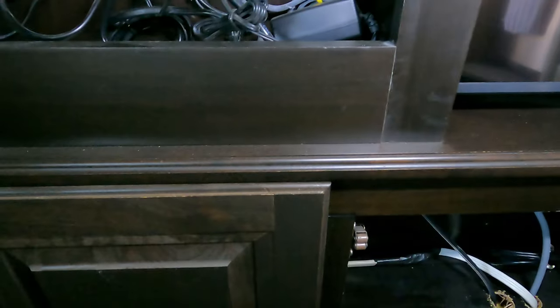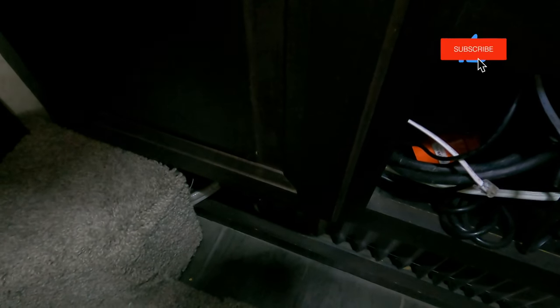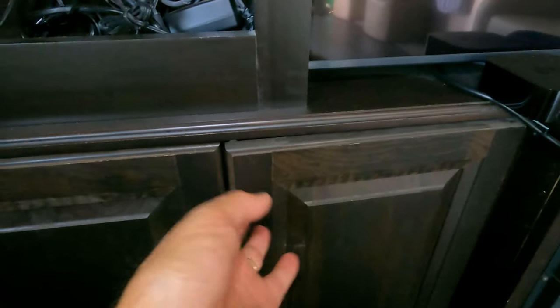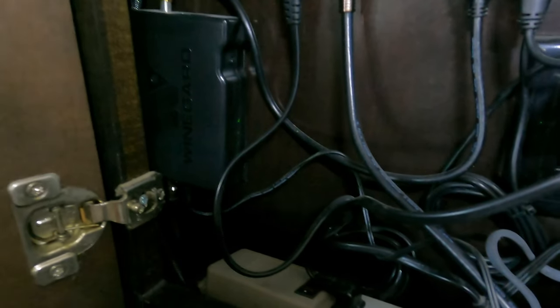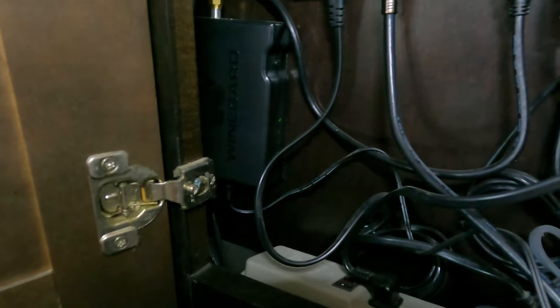Just to walk you through the wiring: I opened up this cabinet and you can see the gray wire that runs all the way down, underneath through all the cable runs. Every install is going to be totally different, so I can't show much more than that. The key point is you've got to snake the RG6 coax into your entertainment cabinet, and it cannot go through any switches or splitters — it must be a direct connection.